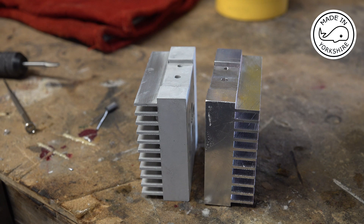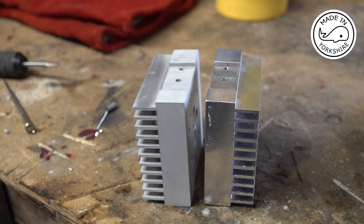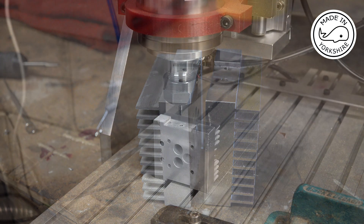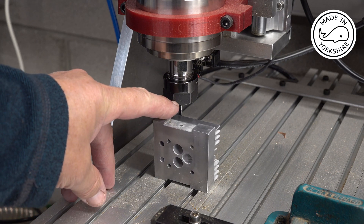You can see how the aluminium gets discoloured by the alum. I'm having a total rethink — I think I'm going to try and use my CNC engraver to get that out. The CNC idea hit the buffers straight away because I can't actually get the height on the spindle, so I might have a go at putting it on the rotary table and milling there.